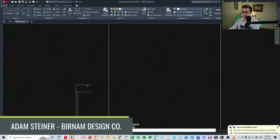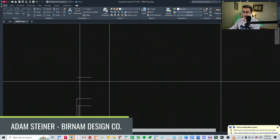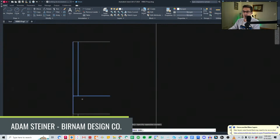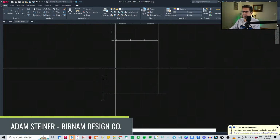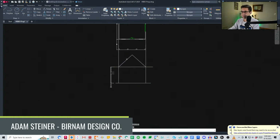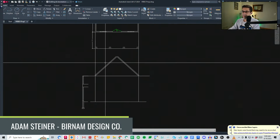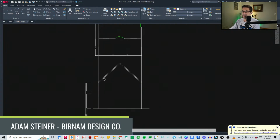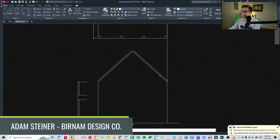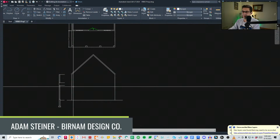And then we can do, oh yeah, I was going to show. So the sidewall here, let's just plan as a 6-foot plate. I think that'll help 2 things. One, bring down the overall scale of the building so it feels a little cuter. Can I say that? Can I say cuter? And then 2, I guess that's really the main reason. I could do a full plate, but it's going to start to look massive. And I want it to feel like a little bit more built in.